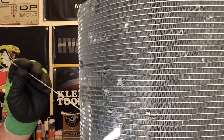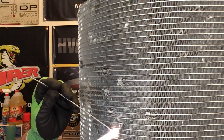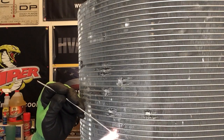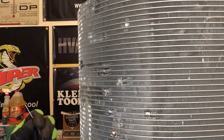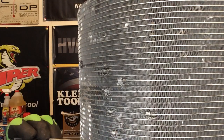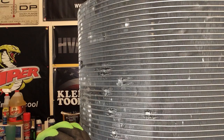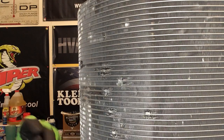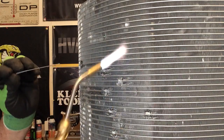Let's find this other puncture down here. After you do a leak repair, just like all leak repairs, you're going to have to pressurize it with nitrogen and get some Big Blue leak detector and do some soap bubbles. You may have to come back in and do a little top-off. But you can see how easy it is — I'm not even prepping it. These coils are brand new; I'm actually using some of the aluminum that's there as a bonding agent.